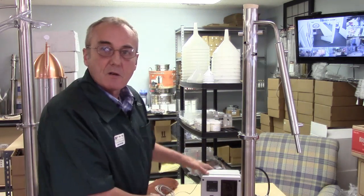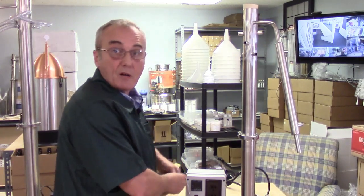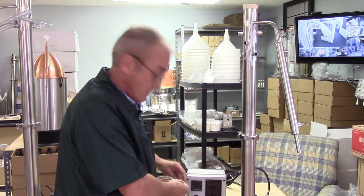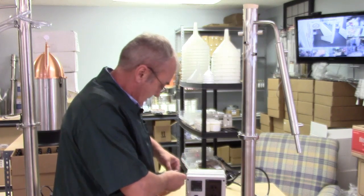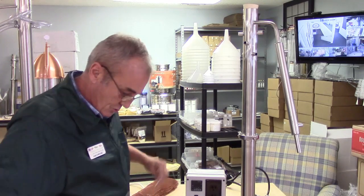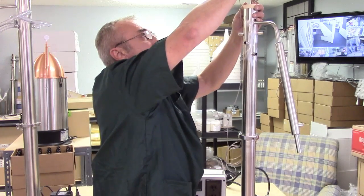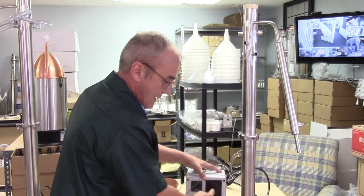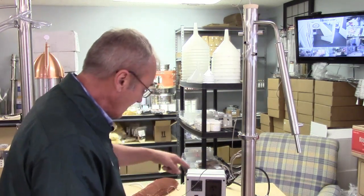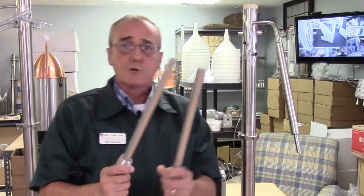In this particular case we've got our PID controller that we built — we built it right there on the counter. I've sold a couple of them. They work and they're a whole lot cheaper than some other online PID controllers. Here's the thermocouple — the thermocouple goes right in the very top, you turn on the PID controller and it adjusts the heat. You can also use the heat band; for the electric version we've got two internal 1500-watt heat cartridges.